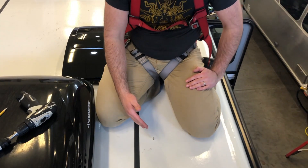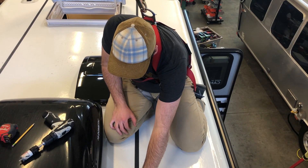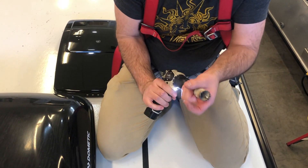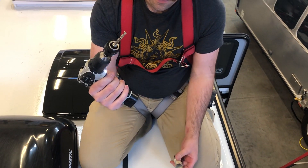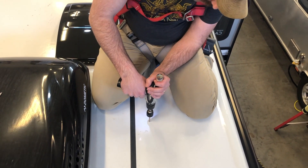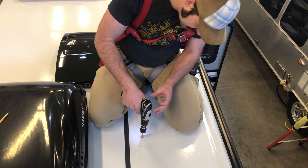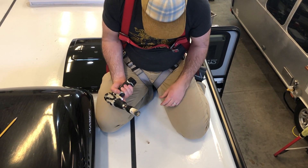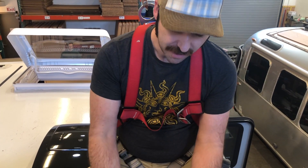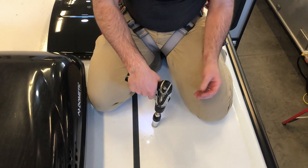We're back on the roof with our hole saw. In this case, it's small enough that I can actually just pull it right through. Now we want to start drilling using the hole saw. You can use multiple different sizes, but I prefer a smaller drill. The first thing I like to do is pull the hole saw off and use just the drill bit, because you want to prime with the actual size drill bit first. With fiberglass, you always want to go nice and slow — you don't want your drill bit to catch. We've gotten through the fiberglass and through the wood, so at this point we should be down into foam and it just falls right through. Now we want to get that fiberglass and wood piece off, so getting the hole saw back on. I like using a small drill because if you catch anything, it's not going to break the wire or twist your wrist off — it gives you a little more control and you can feel more of what you're doing.